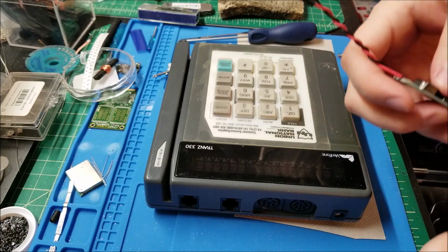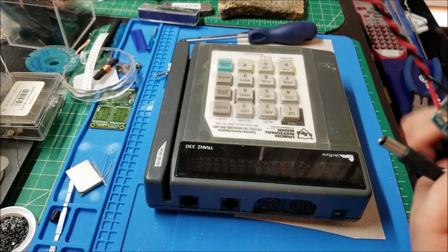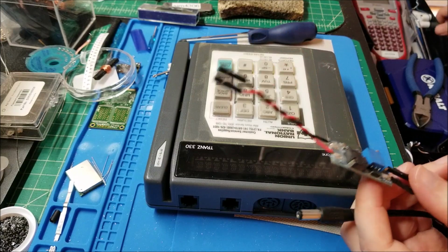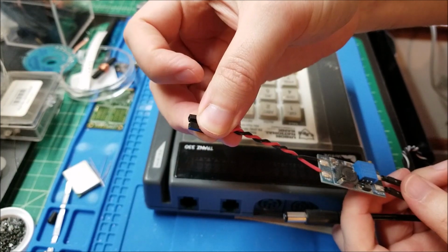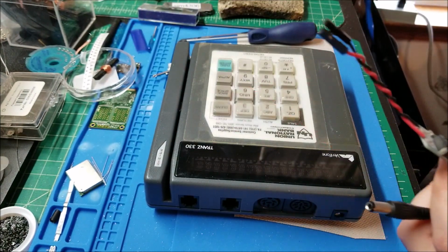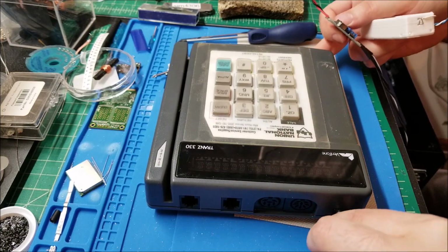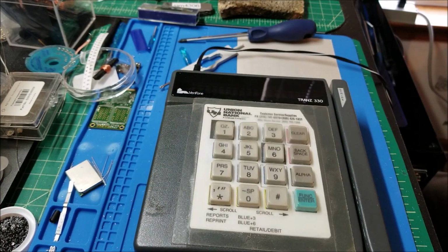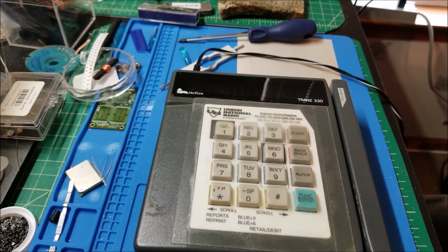Have this board here, which is just a DC-DC boost converter. And I think I have it set to around, let's see, 9 volts right now. And I just have little female leads. I can plug this into like a LiPo charger or to provide power. Let's just see if this does anything at all because the size is correct. Polarity might be backwards, but we'll see. It looks like there's plenty of protection diodes on the input side anyway, so even if we get it backwards, it shouldn't blow. But let's just see.